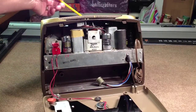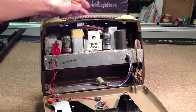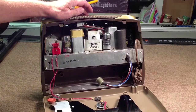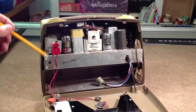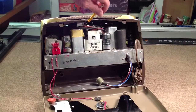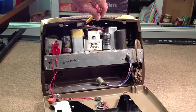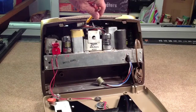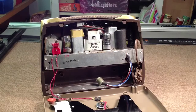When this little lever trips, the wave magnet pops up, and it also releases a slide switch right here that spring pressure holds open. When the doors are closed, they push against the spring and turn the radio off. When the pressure is released, the spring goes back to the on position.